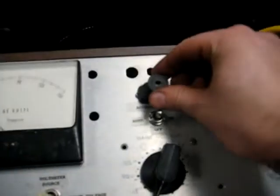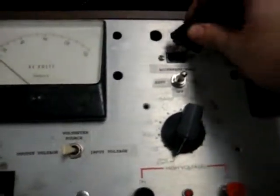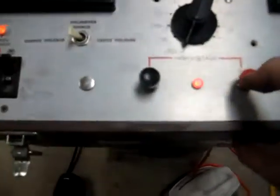We've got safety interlocks on the transformer, so if we have the voltage turned up, it won't turn on until we turn it down. And then the contactor goes. This can also be wired up as a dead man switch. Remove that and it turns off. So yeah, there's a meter and it goes up and down. That's pretty much all there is to this control panel.